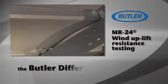The other thing is we're actually pulling a vacuum on this seam. Nobody else could do this. Their seams are so loose that the air would flow through. We have to put a plastic sheet under it to test it. In this case, it's not only watertight, it's also airtight. And so long as that deformation is not permanent, it returns back to its original configuration. You've not exceeded the elastic limit of the steel, and you can do it time and time again. It's all part of the Butler difference.